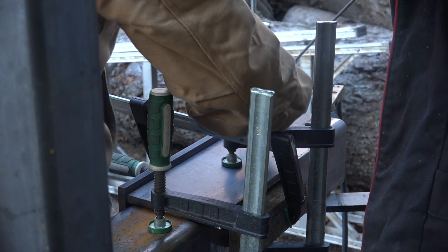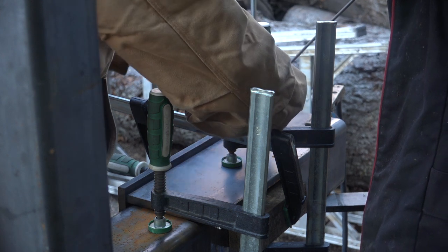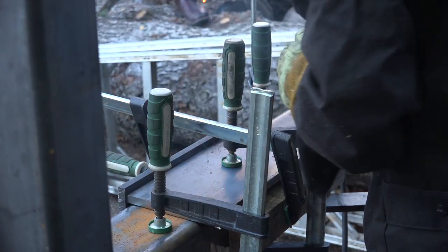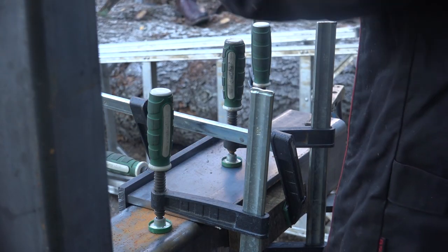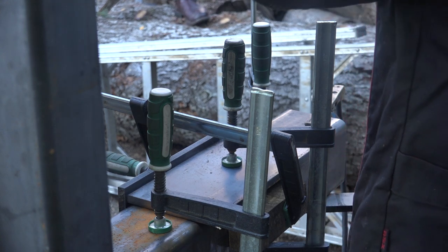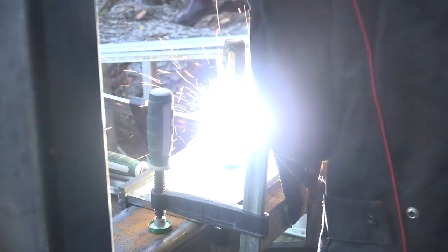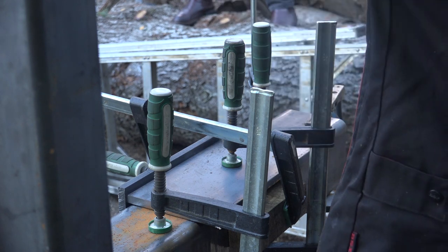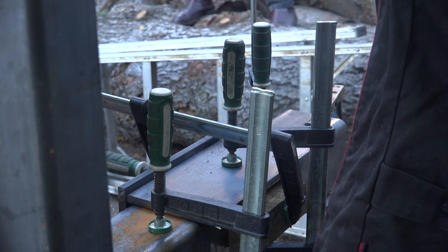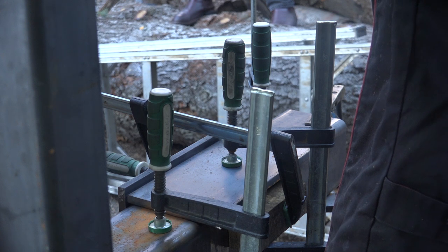Yeah, basically you'll scratch, so as you're coming down, you're trying to get it to arc. And once the arc forms, it'll stay, and then you can keep it pretty close to the surface. Did it work? Yeah, but I think it's not good. It's a little small. A little more, yeah. Wow, you're like an expert. And I didn't start that easily the first time I did it. I got stuck like 600 times.